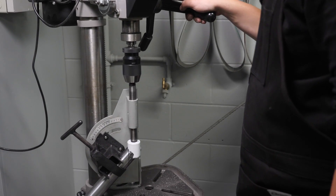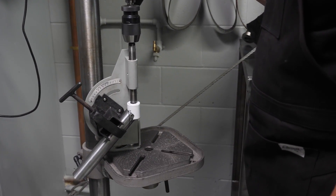Now that we've seen how the paper template is used, we'll go through the process using a specific notching tool. As we discussed in the tool section of the course, these are available in models designed to fit in a drill press or free standing. For our demonstration, we'll be using one in conjunction with our drill press. The quality of the completed notch will depend largely on how the notcher is secured to the bed of the drill press — we want to ensure the chuck is concentric with the notcher and properly tightened. It's also important to adjust the bed height of the drill press so that we have sufficient cutting depth to complete the notch.